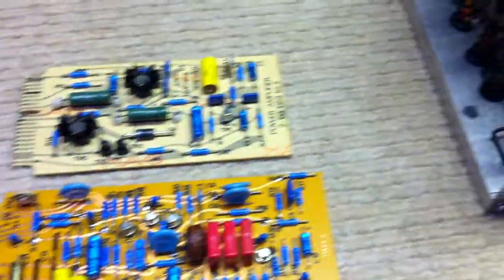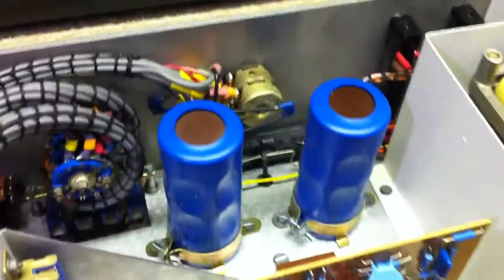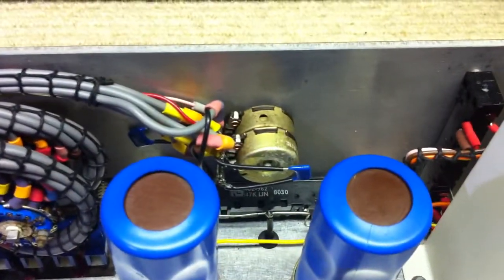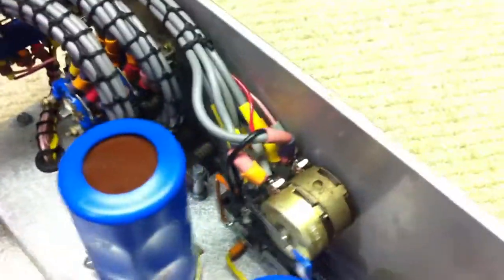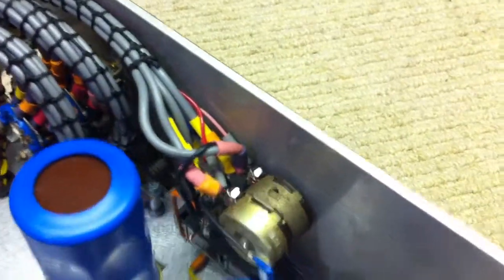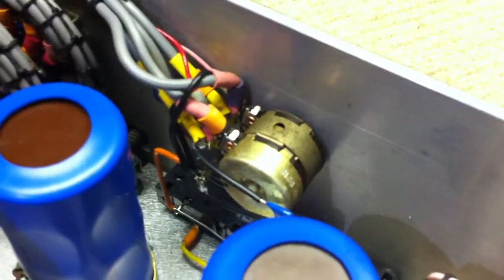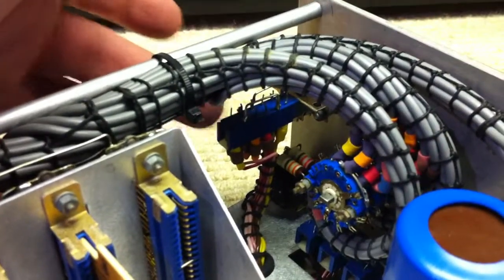It's a very nice little thing and it came from Jude, but I think I should give it back to him because he kind of treasures it. Also, if we look at the volume control, it's been got at too — I don't know whether it would have had loudness taps on it, because if you look carefully at these red and pink wires, they've just been soldered randomly, and the soldering is very poor. These wires go over to the loudness switch.